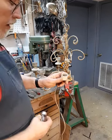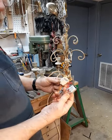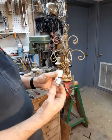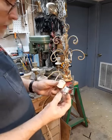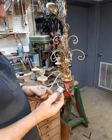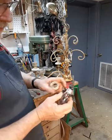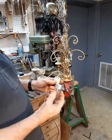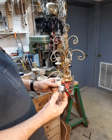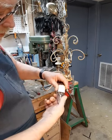The sockets that came out of the chandelier are the familiar socket and bulb that's in most lamps and light fixtures in the United States. And this is known as the E26 bulb and socket. E stands for Edison, and the 26 stands for 26 millimeters. Now, this particular design of thread and socket was patented in 1890. So I can't tell you why it's the only metric thing that's in America today. But that's the way it works.